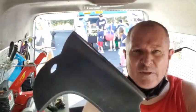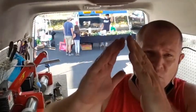So what we've done is we've convex beveled this thing and mirror polished it. What we did with him, he was the first guy. Everybody was at about 22 degrees, even more, some of them. And I said, let's try and drop this angle down and we'll get better cutting performance. Of course, we're convex too, so you get a little more strength. So we dropped that angle down, we went to 20, 19, 18, and at 17 degrees, the edge chipped and started to roll. And so then we just brought it back out to 18 degrees, and it's been 3 years and I've sharpened these, I don't know, a dozen times. I do them every couple months because they're constantly whacking. They never chip and they never roll. So what we've done is we found that optimal angle, and I just think that's cool.